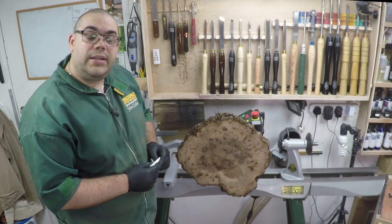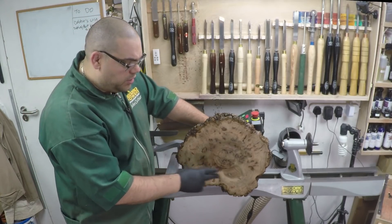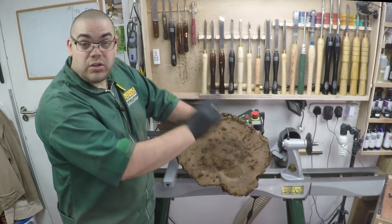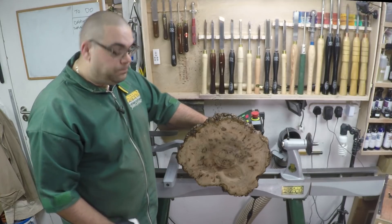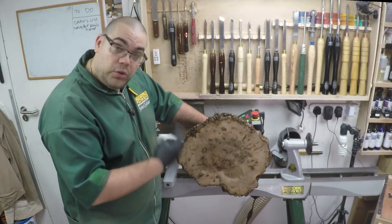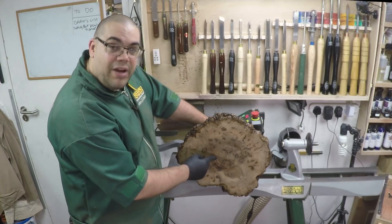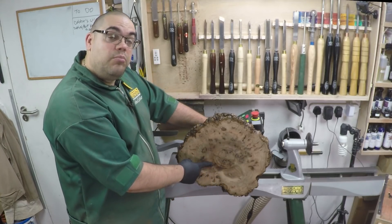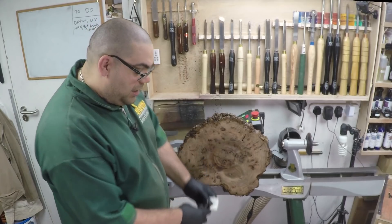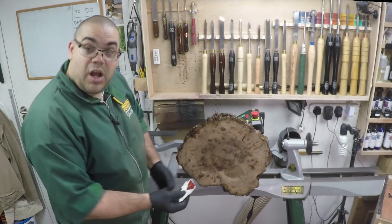That's it sanded all the way down to 600 grit. I've come out as much as I could but obviously because of the live edge you do have to be careful as you're sanding towards the edge, which is why I used the orbital sander earlier. Now I'm going to apply some colour and I'm going to be using a water-based colour. I'm going to put a dark red in the centre, then a black ring, and then the recessed area is going to be brown. I've folded up my tissue into a small pad, got my colour, spray a little bit on away from the piece and start applying.